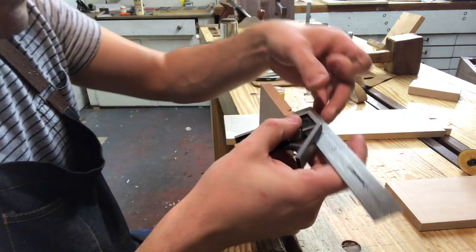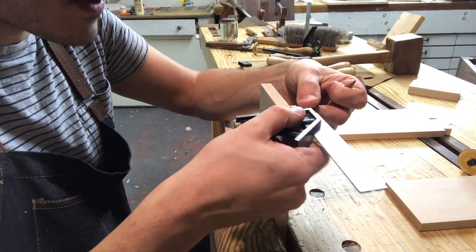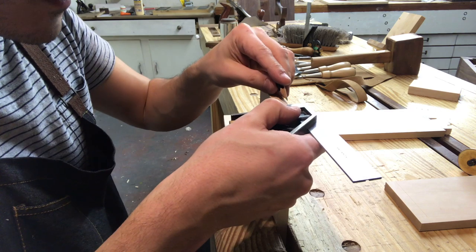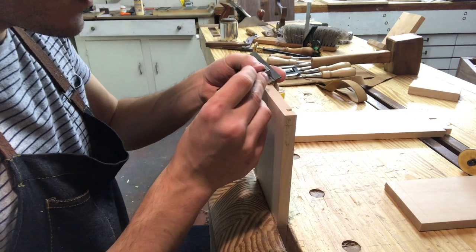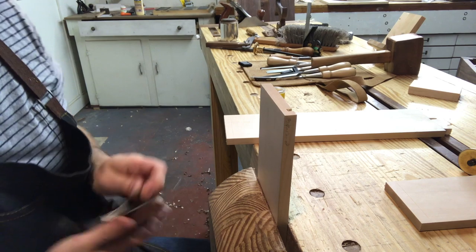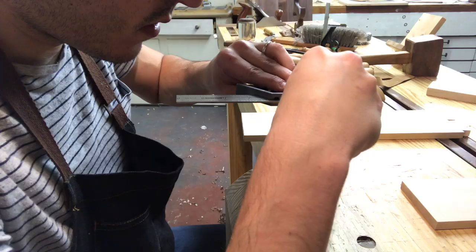What I do is I just extend my square up against the end, and I extend it a quarter of an inch past the groove. Okay, so there's the groove. This is going to go past the groove by 1/4 inch, and then I mark it. Then I just basically come back and do a quarter inch on the other side. And I'll transfer my lines across.